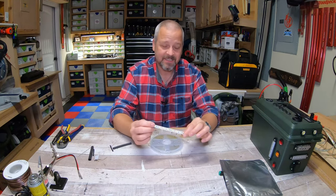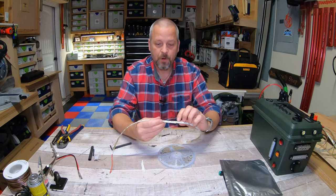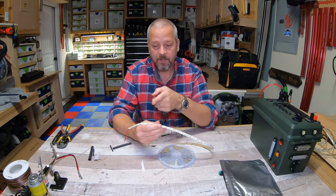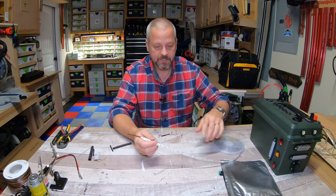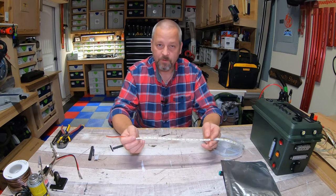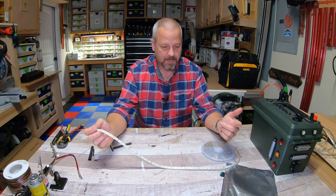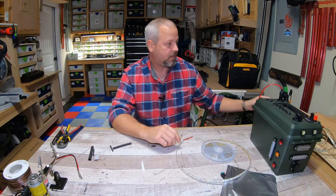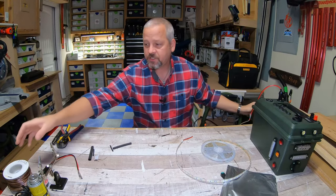Now you can cut this light strip wherever you want, as long as you cut it on the little marks all along these light strips that have scissors. You can cut it there. Don't cut it anywhere else or you'll interrupt the flow of electricity going through this whole thing. So only cut where it tells you you can cut, but you can cut this thing to 1 foot, 5 feet, 10 feet, whatever. On this one that I'm gonna build, I'm gonna make this one 10 feet long.